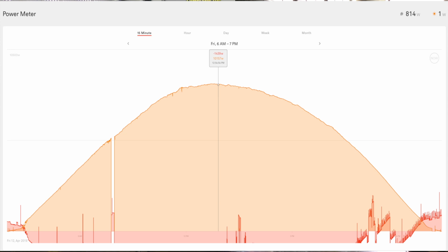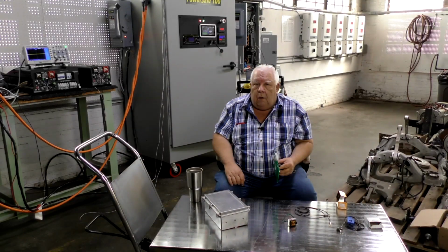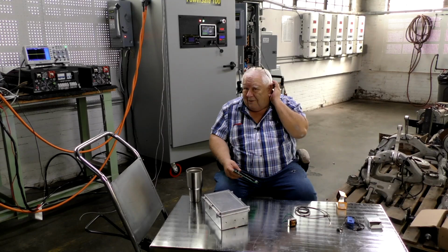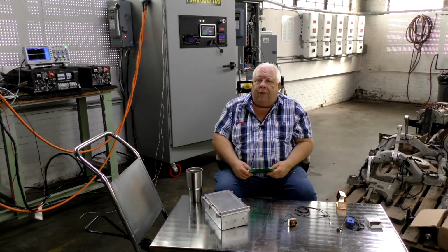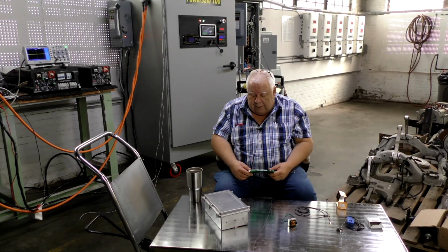And that's fun to watch, but it doesn't work for us really, because all the protocols of communication are entirely closed. Now, I could probably reverse engineer that, but it's almost easier to do our own device. For one thing, we don't need 4 sensors. We can tell the direction of AC power flow by comparing the phase of the current and the voltage.